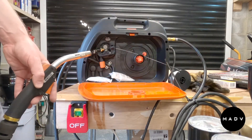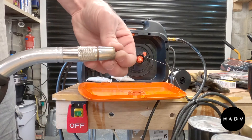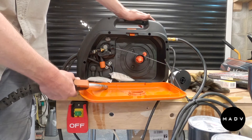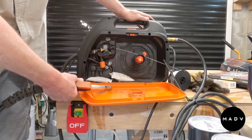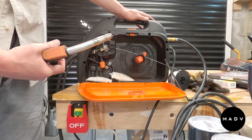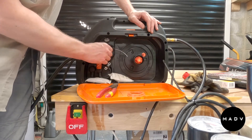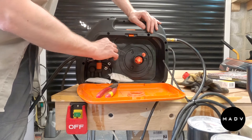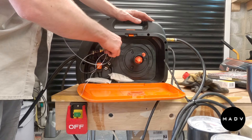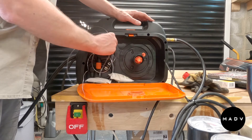The biggest lesson I learned is that your earthing needs to be pretty good. If you're repairing something old, you need to really clean the aluminium so the contact is great. Otherwise, when you try to weld, the wire gets caught up and can't push clear — it causes a blockage in the push mechanism that feeds the wire up to the handle, and you end up having to pull out and waste all the welding wire every time.